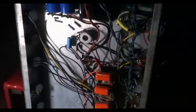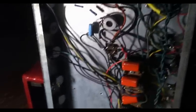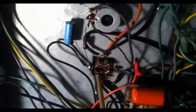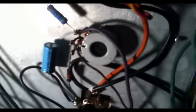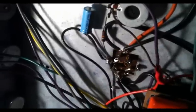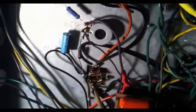Okay, I think I've isolated exactly what the problem is, and it's not those tubes after all. It is something close to them, but it's not them. Remember, we spoke about the removal of this can capacitor from the circuit. Well, when you reach around and you just touch or wiggle the physical can, you are able to reproduce the problem, and the reason you're able to reproduce the problem is all these components, including the bias circuit for those output tubes, are all grounded right here with the grounds of the can capacitor. So this is kind of a lesson here.